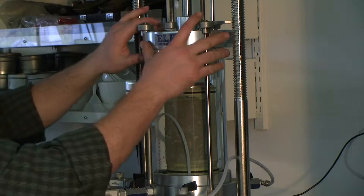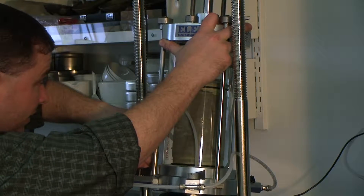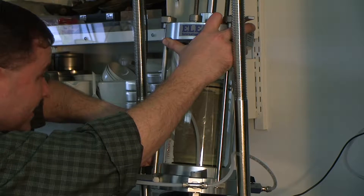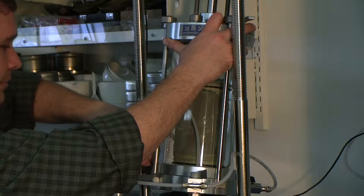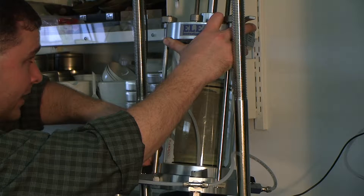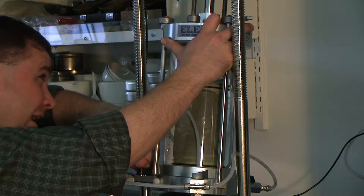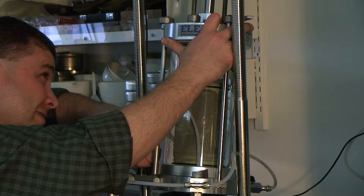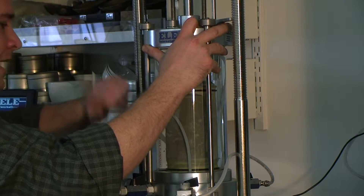What I want to do is try and eliminate as much air as I can from inside the cell. I tip it at the angle to where the air is going to reach that bleed screw, then I slightly open the valve again to make sure all the air escapes to that side, until I get water coming out of the top.